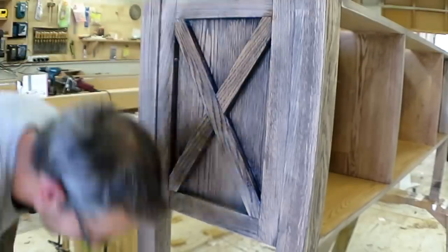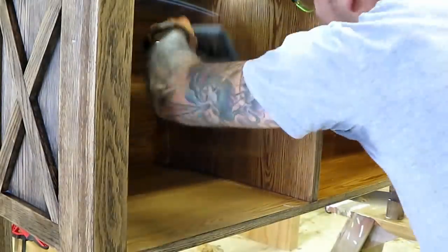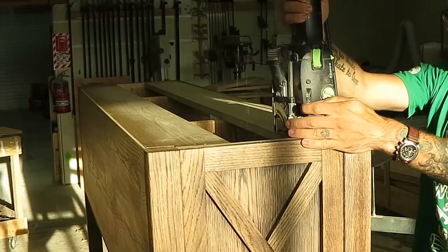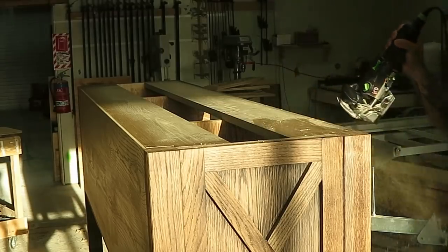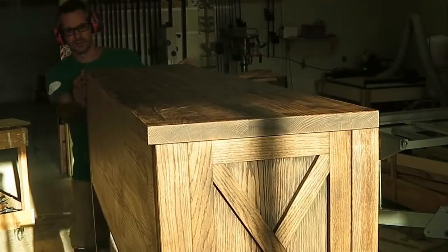And for those of you wondering about the MDF, I was very careful to clear coat all the exposed edges, so all around the back, the bottom, it's clear-coated as well. I needed a few slots in the top of the carcass so I could attach the top properly.